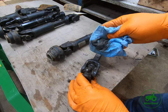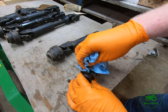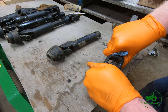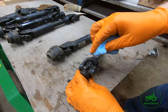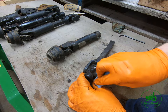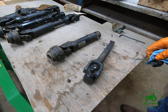If you're just doing some maintenance, you can just get in here and clean up all the grease and grime. You don't need to get it too clean because it's not necessarily hurting anything — it's just unsightly. But what it does let you do is inspect the u-joint, which seems perfectly fine. At bare minimum, get in there, clean it out, and inspect everything. Then we'll come back and work on the tractor side of the drive shaft.